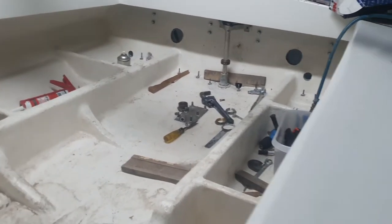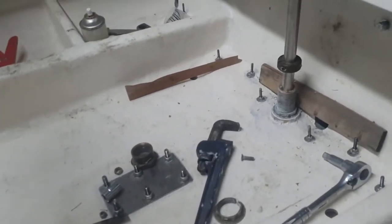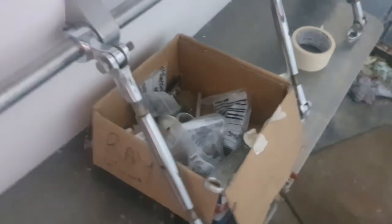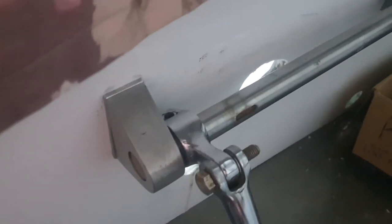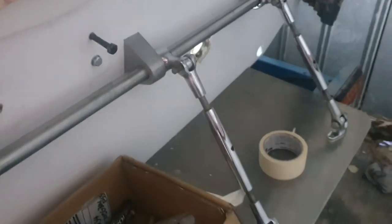The skeg's in — that's all bolted in and ready to go. Still got to cut the top off the bolts, but the rudder took a fair bit of time. It's hanging down a little bit and not sitting in the right place yet, but I made sure it was all square with the bottom of the boat. The cavitation plates are all bolted on. Those brackets on the top had to be mucked around with — slotted those holes as well to get the shaft to move nice and free.